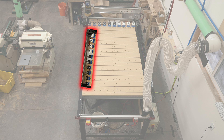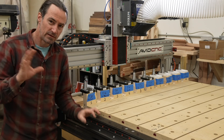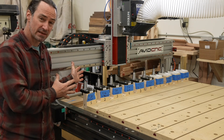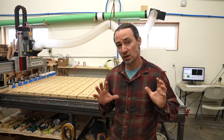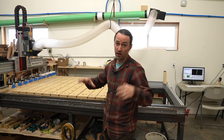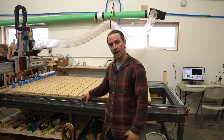You could put the rack at the left at the X-min or at the right on the X-max. Now if you have a 10' machine, just put the rack at the back of the table at the Y-max and don't worry about it. Similarly, if you have a 5' wide machine and you only want to cut a 4' wide piece of plywood, then you could just put your rack on the side of the machine. For everyone else, I'm going to discuss the four basic positions you could put it and the orientation of the rack for each option.